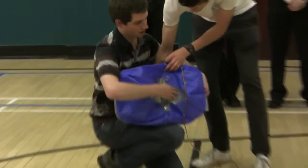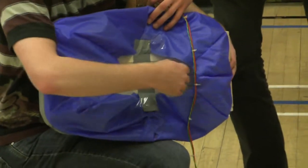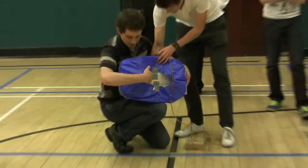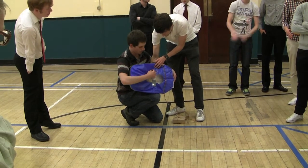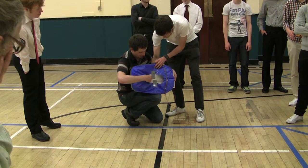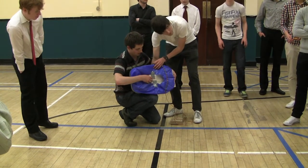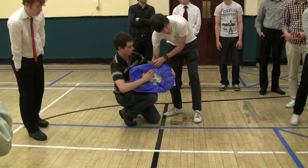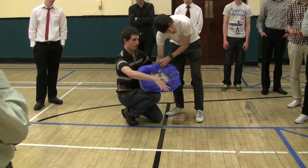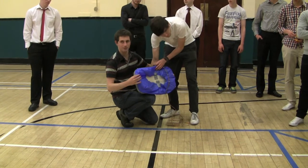The skirt is sewn — this is Ward's handiwork. The skirt comes down and is then pinched in, held at the sides to prevent it from blowing out and letting air escape. Underneath the fan there's a wooden air splitter to direct the air into the cushions, rather than straight into the ground where it would just escape to the sides. You want to direct it around into the cushions to complete the skirt.